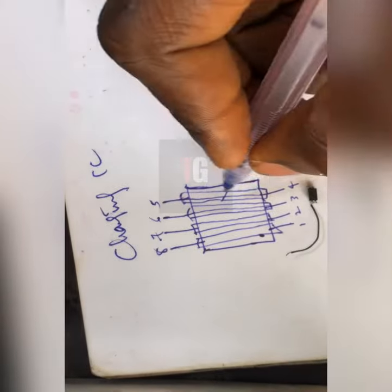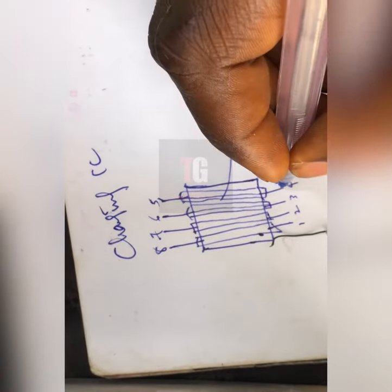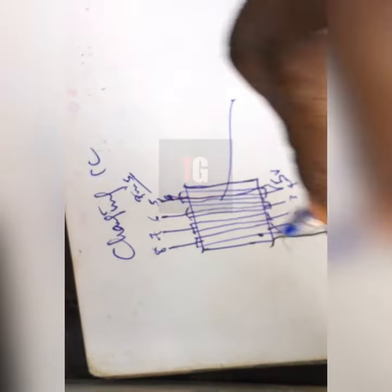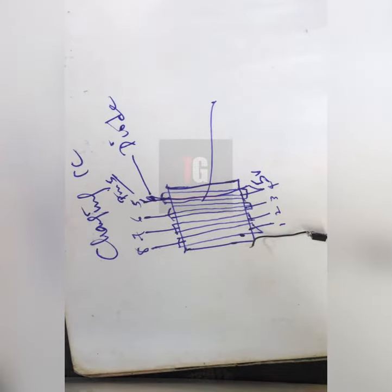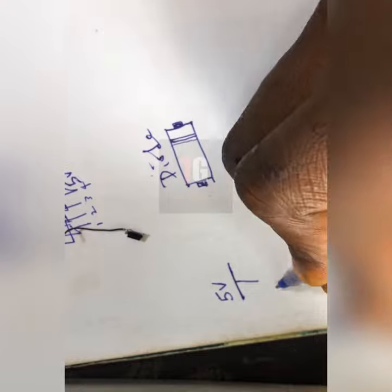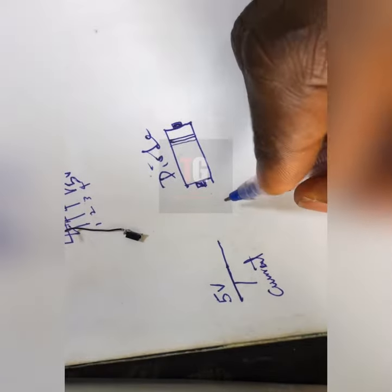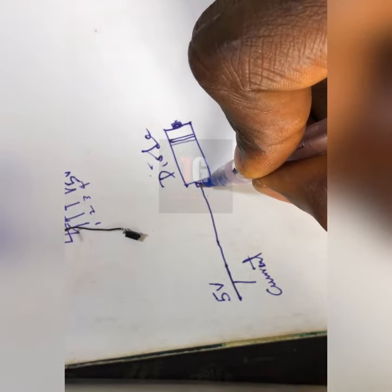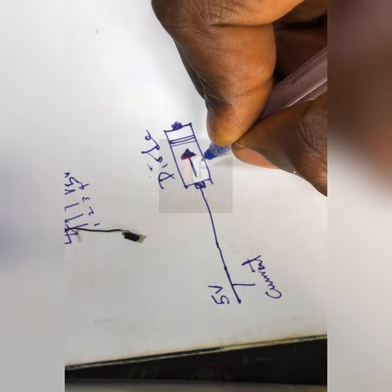This side we have five volts. This is our charging IC. I've bypassed this charging IC. We have a 5 volts here — so this 5 volts we have to bypass it to this place — to pin five. So I said the diode will come in here. Now the five volts is the current coming this way. This line is represented as our current. Now instead of the five volts connecting directly to the IC leg, it goes through the diode.